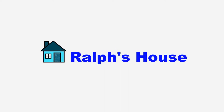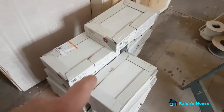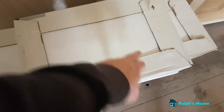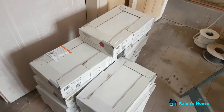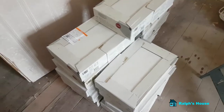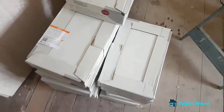Hi, I'm Jimmy the Tiler. Welcome to Ralph's House. There's all the new tiles — they're long ones, and we're going to run without a border. Plaster and tiler seem to think it'll look fine without one. They are a pain, especially the glass ones because the tile grout doesn't stick to them properly and then you get watering and it starts going mouldy — you certainly don't want it on plasterboard. So that's the wall tiles.